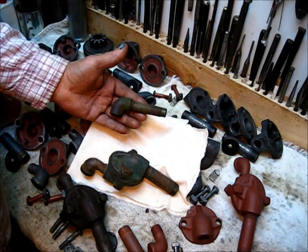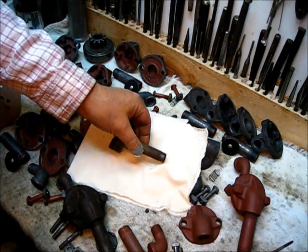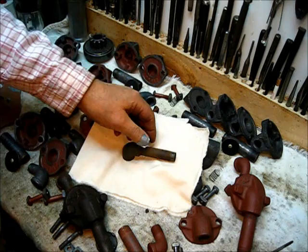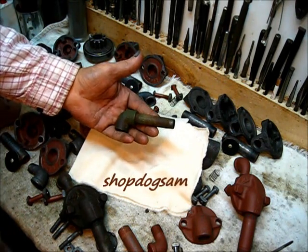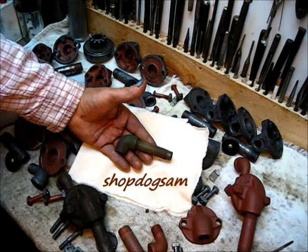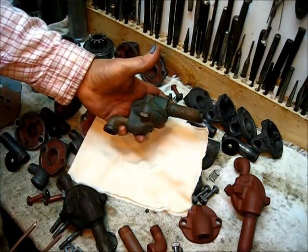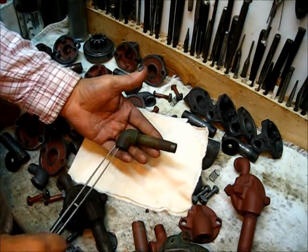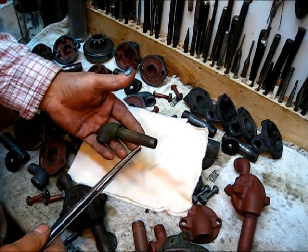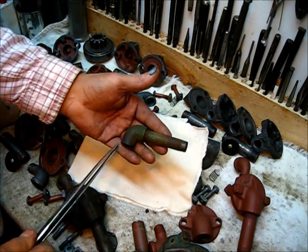This part here is a subject of some controversy — that's a rear breather on a very early model. It did not have this on there originally. This is factory original, and I do own this engine. It's a 3/8 pipe thread in the rear of the engine.